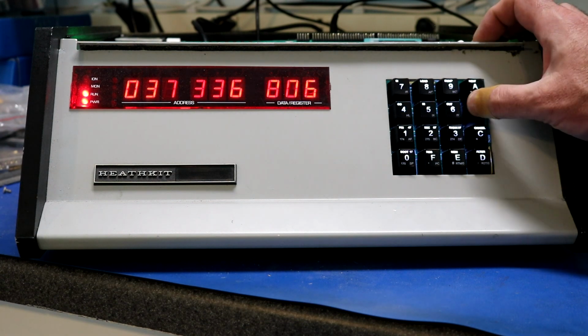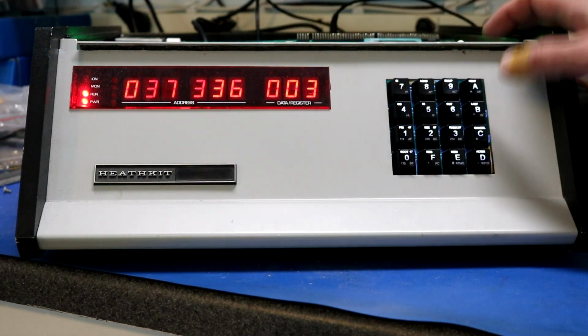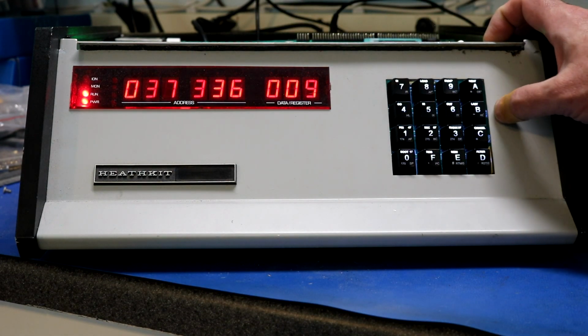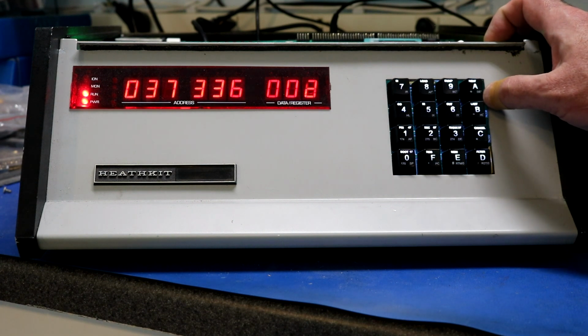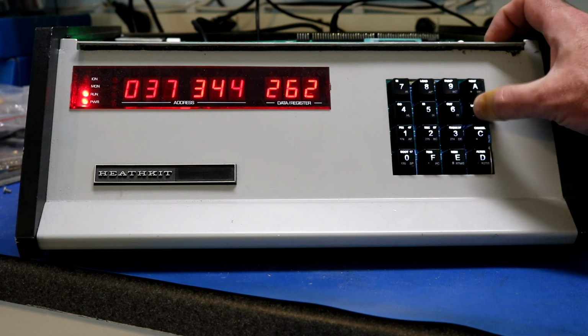You can see other stuff in here, like here's my digit refresh. This is telling it which digit to hit on the display. It's just a scratch work area for the monitor. The Heathkit panel monitor has the same sort of thing in it, so I intuited what they did and wrote my own. So you can move around in memory.